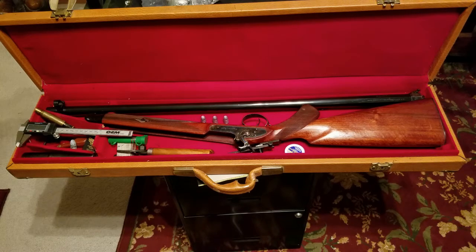This design was set forth by the Sports Committee of the National Rifle Association of Great Britain. For competition, these rifles had certain specifications: minimum bore diameter of 440 thousandths, maximum bore of 460 thousandths; twist rate of 18 to 30 inches; maximum weight of 10 pounds; a half-stock with a pistol-grip handle; a round barrel; total maximum length of 36 inches (this barrel is 32 inches); and a precision tang with fully adjustable windage.